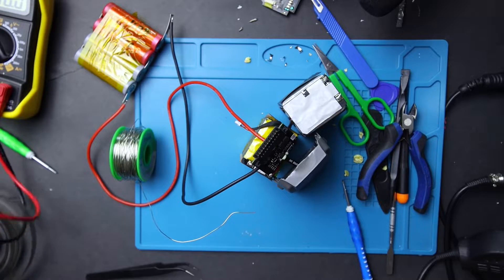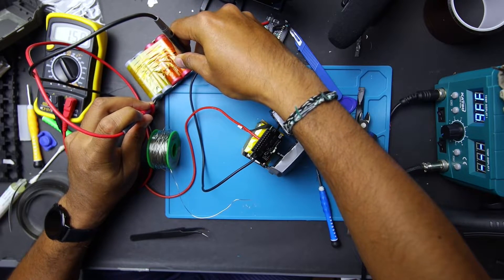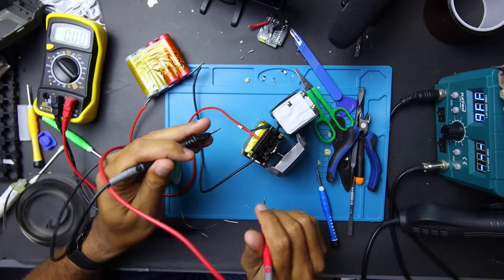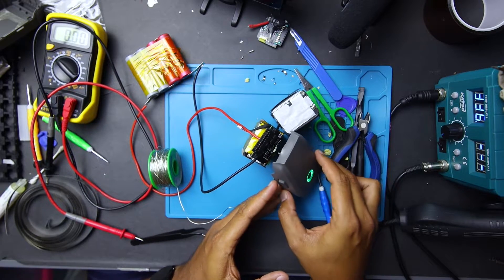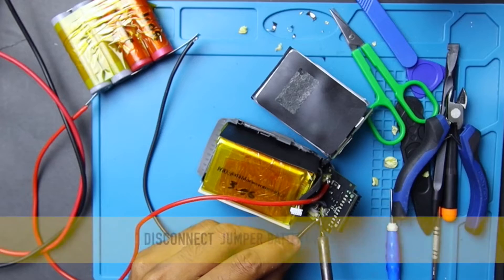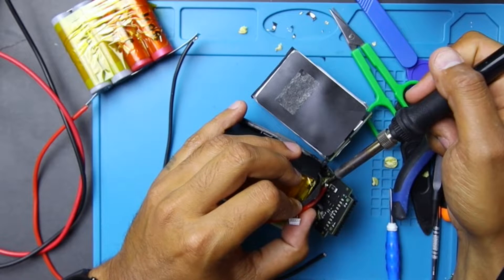We'll just check battery voltage because it should be draining into the new pack now. 15 volts... 15.87. So, the moment of truth — does it work? Yes, it is still on! Bravo. I'll have to disconnect the jumper pack now. There we go — thank you, jumper pack. This one is a tricky one; I'll try to desolder it without shorting anything out. Got some nice hot solder — yeah, that's great.